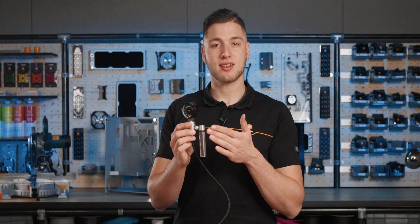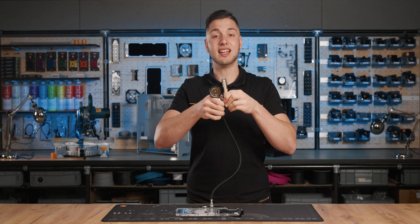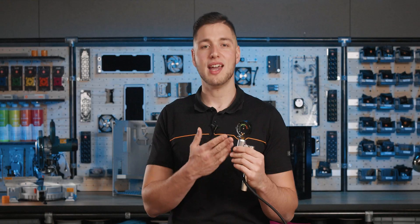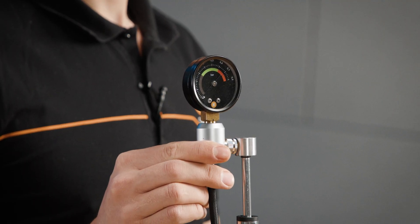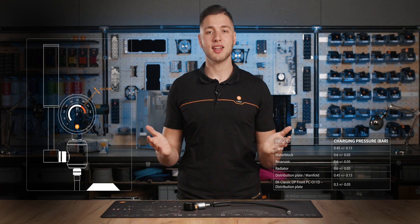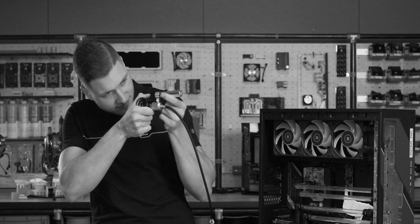For added safety, we also added a protective filter inside the valve so it always stays clean. The stylish and compact pump is on this side and is rotatable if needed — just unscrew the fitting, rotate the pump to the desired position, then tighten it. We also have a new print inlay for the pressure gauge. Keep in mind that every notch on the scale is 0.02 bar. When doing a leak test, always check the charging pressure table in the installation manual.